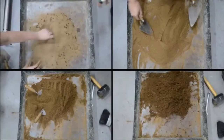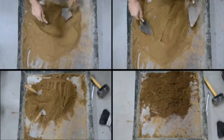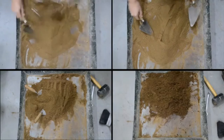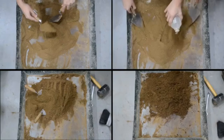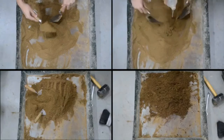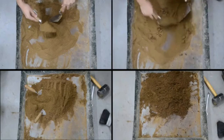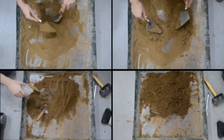Prepare at least 4 specimens having water contents such that they bracket the estimated optimum water content. A specimen having a water content close to optimum should be prepared first by gradual additions of water and mixing. Select water contents for the rest of the specimens to provide at least 2 specimens wet and 2 specimens dry of optimum and water contents varying by at least 2%.